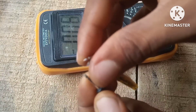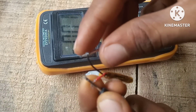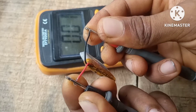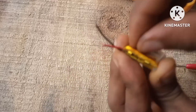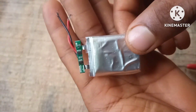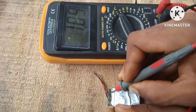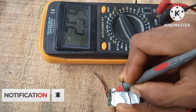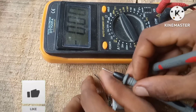As you can see here we have zero volts — that's because we're measuring the voltage at the output of the BMS circuit. Now let's measure the voltage directly on the battery terminals. By peeling the insulation we expose the battery terminals, and as you can see we have 2 volts on the meter. The BMS cut-off voltage was at 2.76 volts, so now we're going to have to boost the battery.